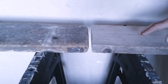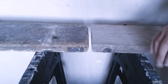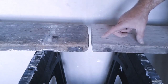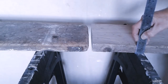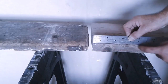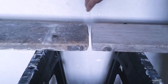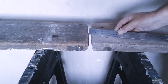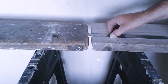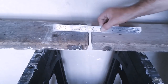If you are using more than one plank joining a distance, then each trestle gap has to be right. Your boards — four times the thickness wants to be the gap, the span — that'll allow for no trap end. The distance between the boards is just as essential: roughly two and a half centimeters or an inch is your limit. This gap here is under an inch, about three quarters of an inch, just over half an inch — so that's okay. And you want your boards to be level so there are no trip hazards.